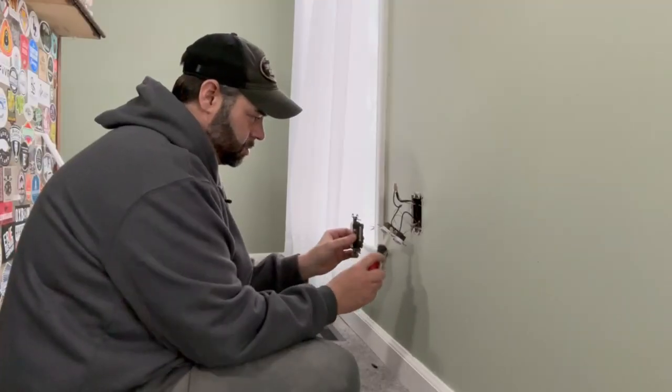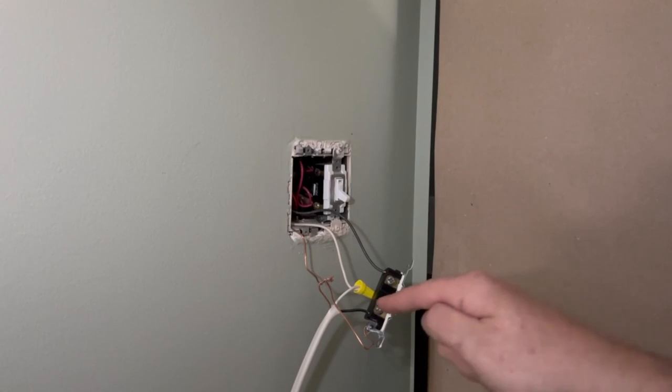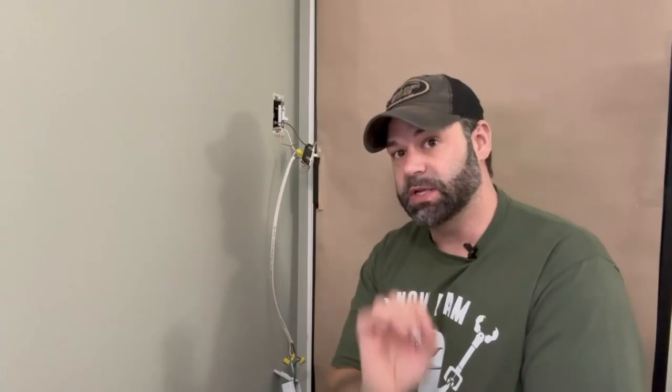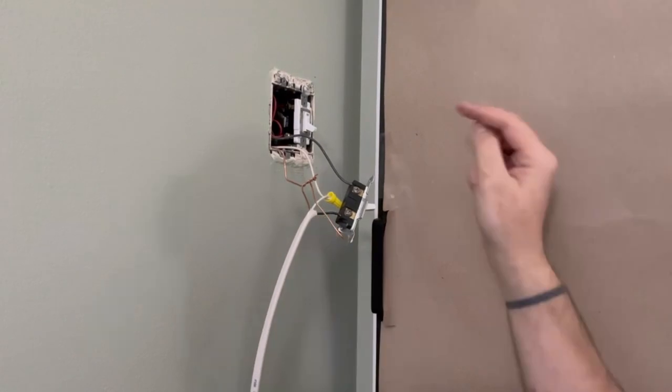Power's off. I was able to get the plug switched over to where it gets constant power on both top and bottom, and connect the wires so all the power is being run over to that switch right there. That is where I had all the problems — that wire right there. When the switch was on, everything worked perfectly, but the second I switched it off it would blow the breaker downstairs.